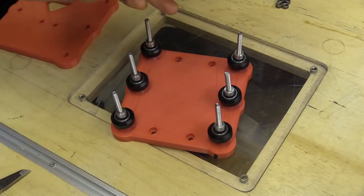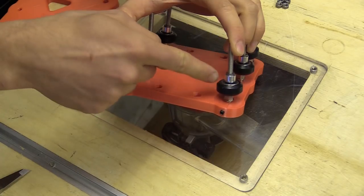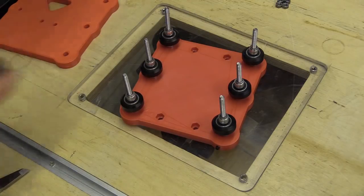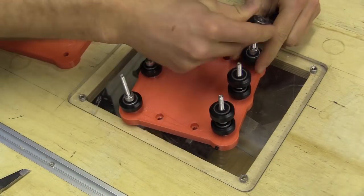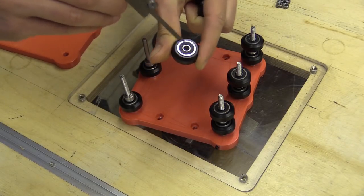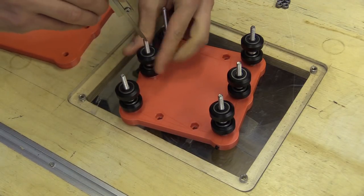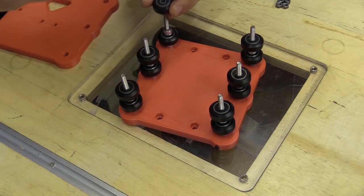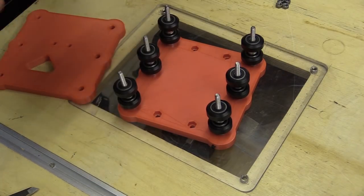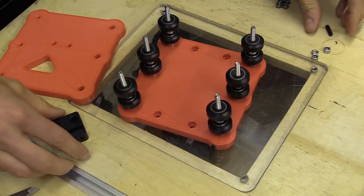The thing to mention at this point is that between the spacer here there's one shim on one side but two on the other. I'll put the opposite wheels. If the wheel doesn't pop down it might be because the shim between the two bearings has slid out - just use a little stick or something to push it to one side. I think I'll actually put the nut block on as well just to make sure I'm not going the wrong way around.